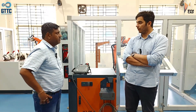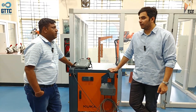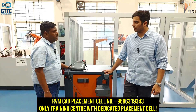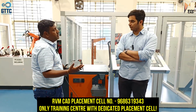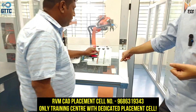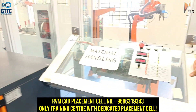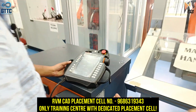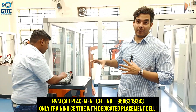So if we have to teach a student robotics, how much time will it take? To know the basic robotics operation it will take two to three days — basic operation, not programming. For programming, we will teach them virtual programming using our software. We have already written the programs covering point-to-point, linear, auxiliary, and circular. To become a professional it should take at least 15 to 20 days of practice. Regarding career options — as all industries are moving to the latest technologies, this is the fourth generation, and every industry is using robots. If you know the programming and operating, it will always be a great add-on experience. Also, if you have basic knowledge of PLC, as you can see these are all the PLC connections — we have already made four auto programs.